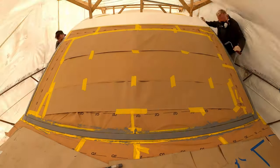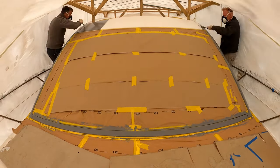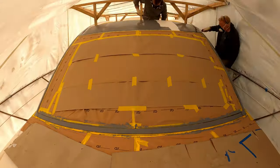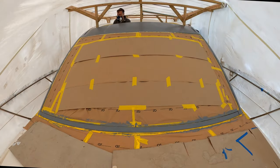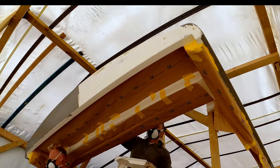Okay, here we're rolling out the Alexseal 442 finish primer using the ANSA 4-inch felt rollers. The primer is mixed at a 1-to-1 ratio with the 442 converter, and then we add a 20% reducer. The primer when mixed is quite thin, so we're being careful not to load the roller too much and make sure we spread the first coat out as much as possible. The second and third coats will allow us to build up the primer further.